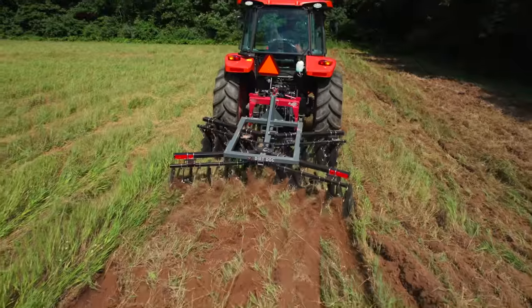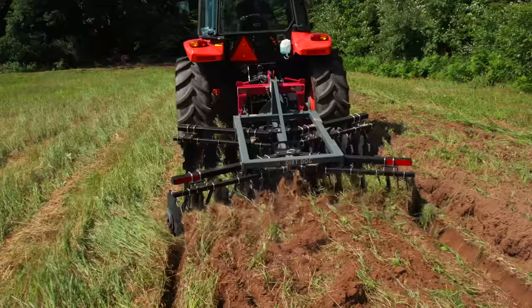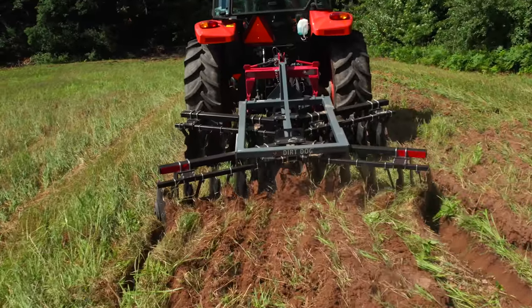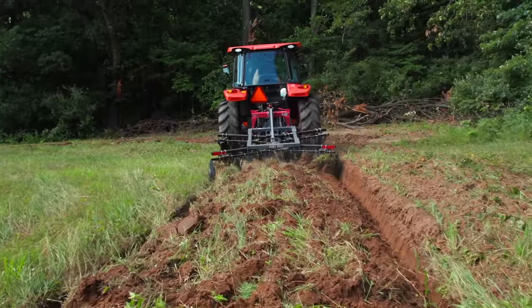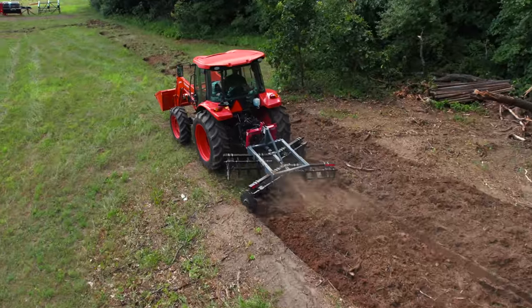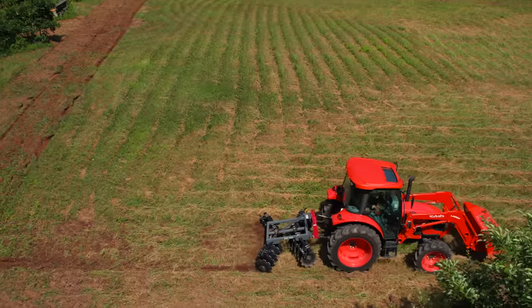And I did a little bit of experimenting myself, trying to show, because, well, you know, I'm not a farmer by trade, right? And so I don't know the most efficient way necessarily to work up a field. And I gave it a go on what I thought might be efficient, but you still find yourself having to kind of 3-point turn around and get back and forth. And it seems like wasted time, but you don't want to do a lot of turning with a disc in the ground. It can really wear out these bearings pretty quickly.